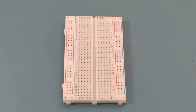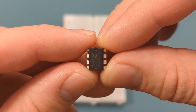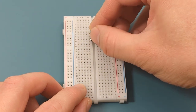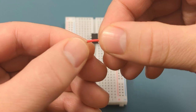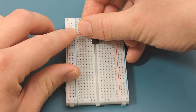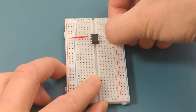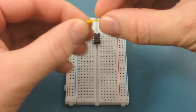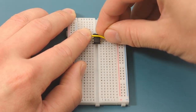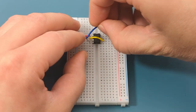Let's set up the circuit step by step. Begin by positioning the 555 timer IC on the breadboard, keeping in mind that the pins are numbered counterclockwise starting from the top left corner. Refer to the circuit diagram if you have questions about the connections. Insert the IC in the middle of the breadboard. A jumper wire connects pin 1 (ground) to the negative rail, and another connects pin 8 (VCC) to the positive rail. Use a jumper wire to connect pin 2 (trigger) to pin 6 (threshold), and another to connect pin 4 (reset) to pin 8 (VCC).